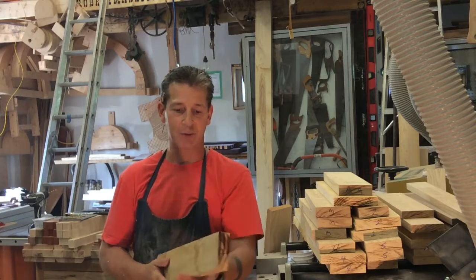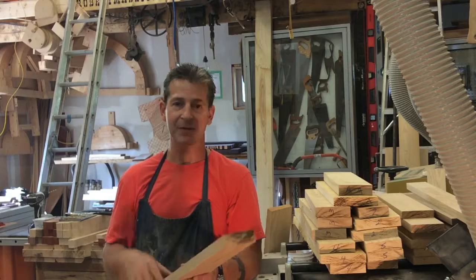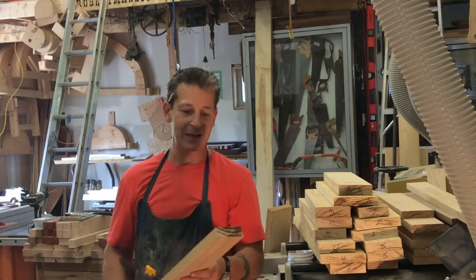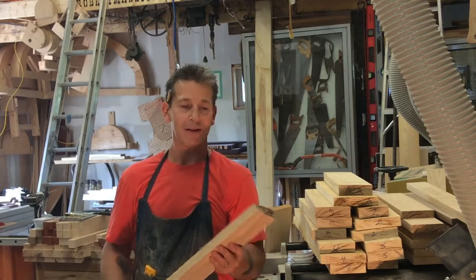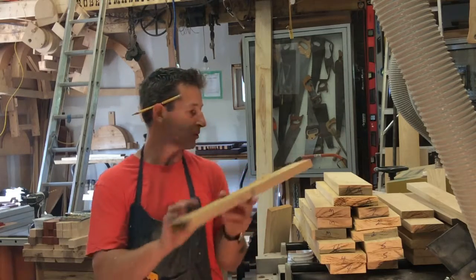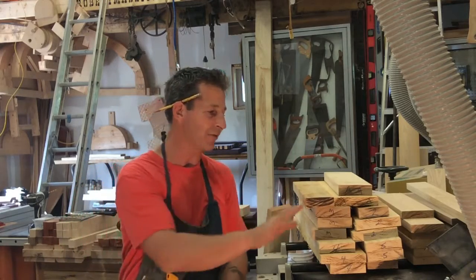I'll cut the fourth side on the table saw and then glue them up for shelves, staying in the clamps overnight. Then I'll run them through the thickness planer once again, then through the drum sander and cut them to the finished length. Then follow with finish sanding, and they should be good to go. Oh, along with a routered edge, just to knock off that sharp corner.